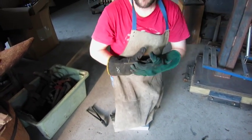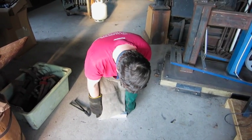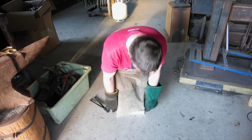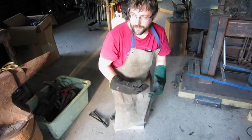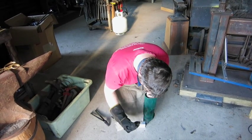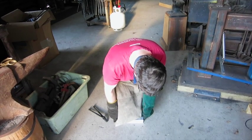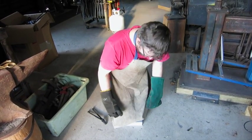We're plate quenching a folder blade that we've been making today at the Tower Valley Forge. We just hold it in between these aluminium plates for about a minute or so. It will go from 1065 degrees down to being able to hold it just between our hands — room temperature. Nice and easy, very easy — no mess like oil quenching or anything like that.